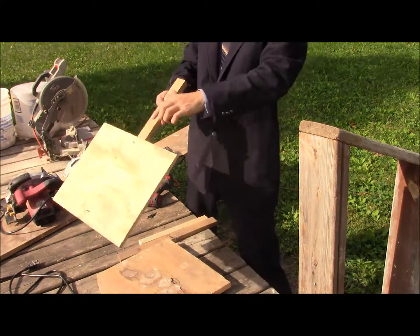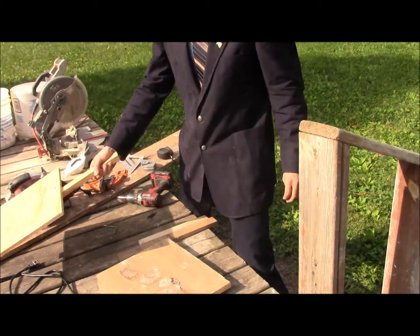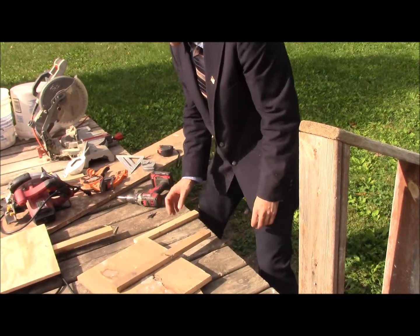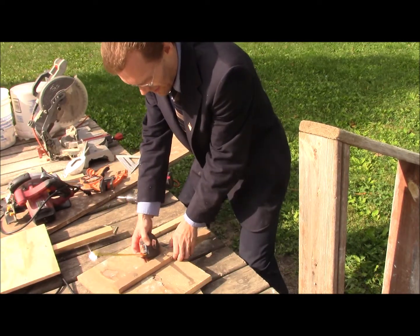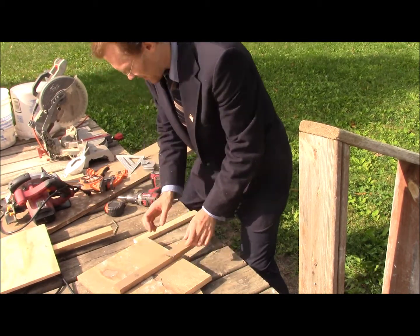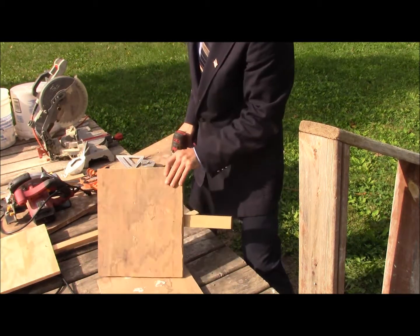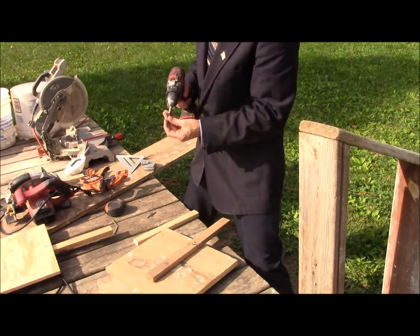So the roof will just attach like that, and see we have the screws here. So that's something that we'll snip off later, to make sure the animals don't inadvertently step on them. So we need the 14.5-inch side. That should be good. I'm going to just try to somewhat center it here. Let's see. I need to come this way a little bit. A little less than 6.5, so right about there should be good. Let's tack this on. Now this wood's a little thicker, so the end is still there, so we'll just sand it off a little bit. Call it good.